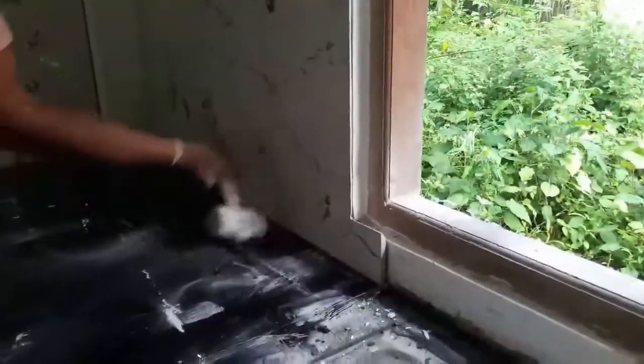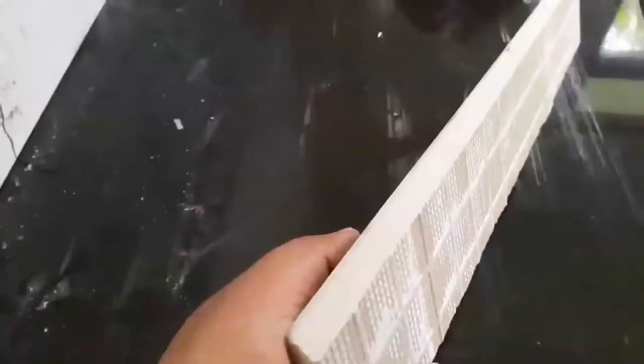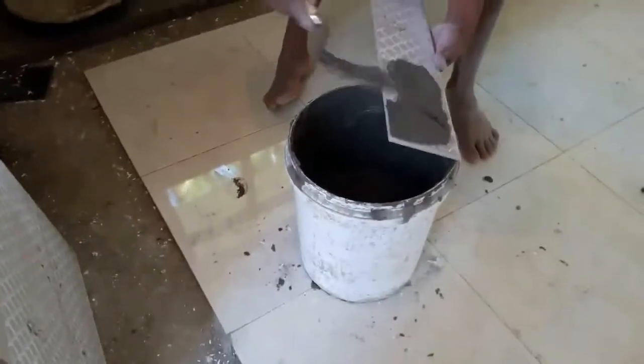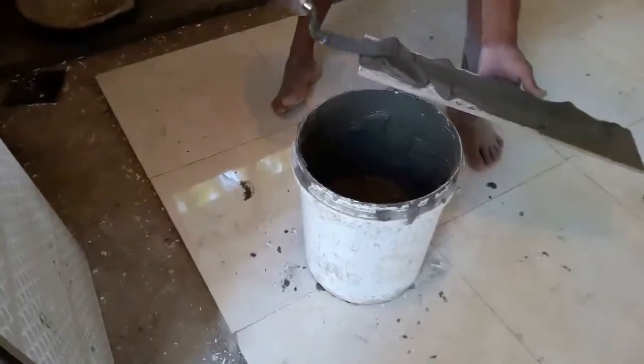As you lay your tiles, always check them for dirt and dust. Wipe them clean if needed. The dust can affect how effectively the tiles adhere to your mortar. Throughout the process, use a damp sponge to clean off any mortar that ends up on top of the tiles. If you need to take a break, always scrape up any mortar overlapping into an area you are about to tile.